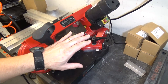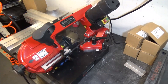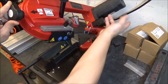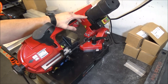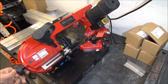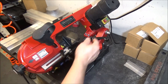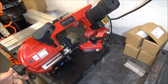What I've done is rewired the switch so that you have to turn it on manually. The switch turns it off, and when you lift the switch it stays off — in order to turn it on you have to turn it on again. This switch has an internal relay: as long as you provide 110 volts to it, it will stay on, and once you remove the 110 volts it will shut off. I reconfigured it so the incoming power goes through this switch, so it will only turn on if the saw is up.